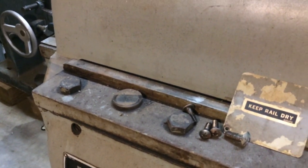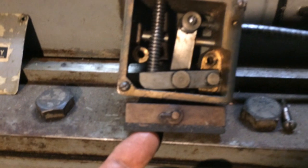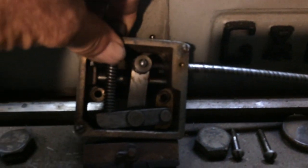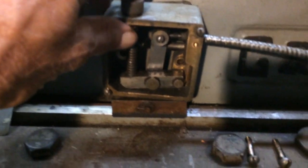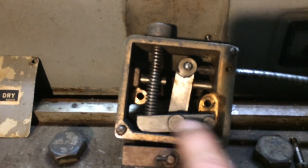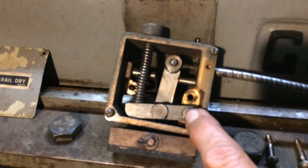What happens with this tool lifter — you can see there's a screw down here, and this thing right here is just a flat piece of metal. On the bottom of this thing right here, there's a brake shoe. This here rubs on top of this bar right here when it's all bolted on there. What happens when you adjust this knob right here is it adjusts the spring tension, which pushes on this little lever right here. This little lever right here is pivoting right here at this point.